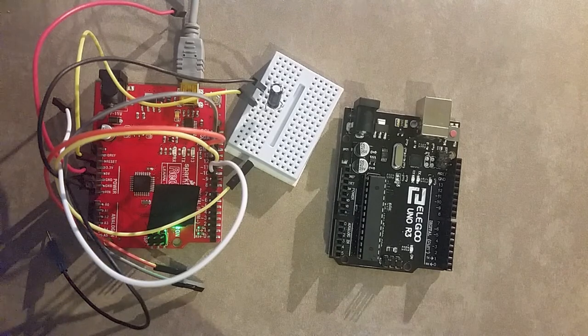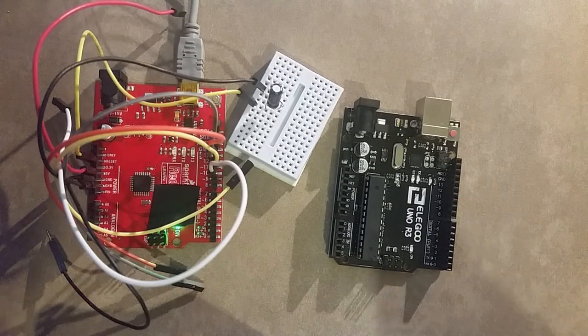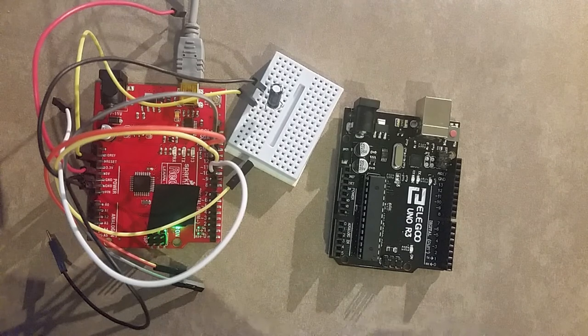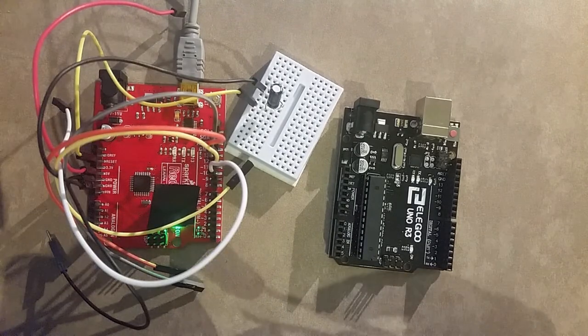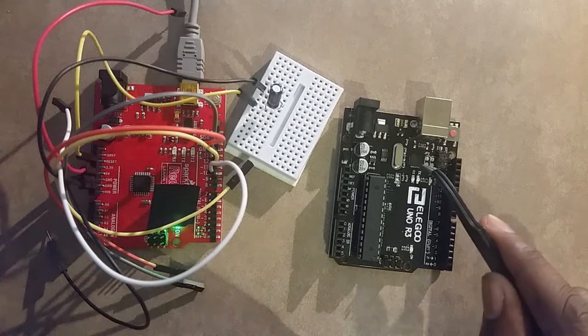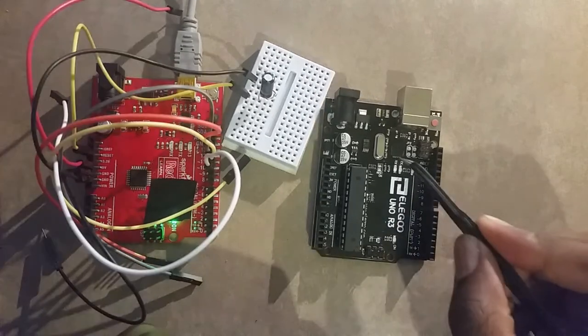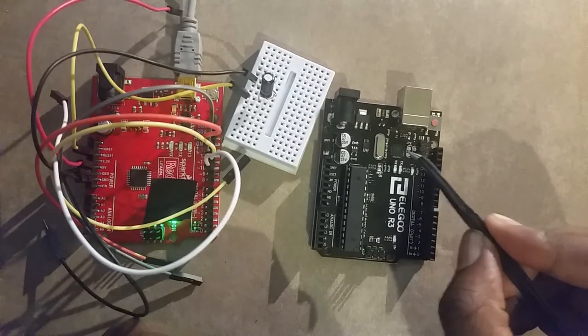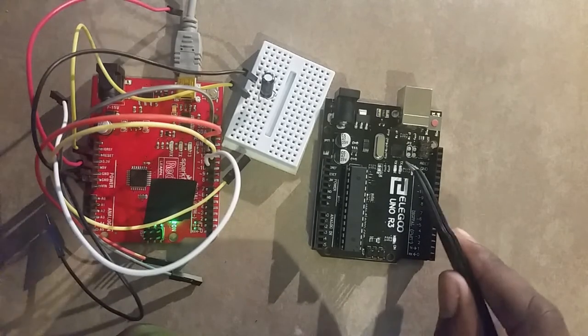Now this tutorial will not work with boards that don't have this chip. If your board doesn't have this chip that says Atmel ATmega16U2 or Atmel ATmega8U2, you cannot use this firmware. If you have an off-brand Arduino board, make sure that it has this chip. I have an Elegoo right here, which isn't Arduino brand, but it's got the chip. My Elegoo has an ATmega16U2 on it.